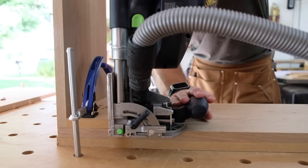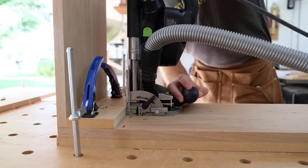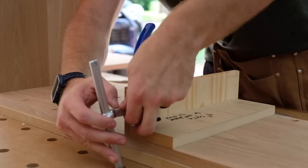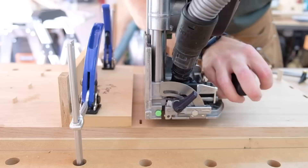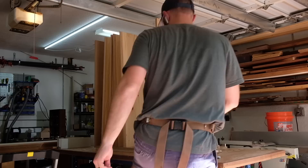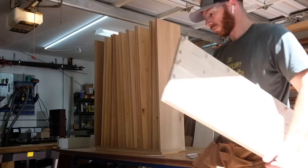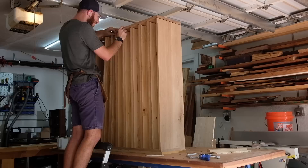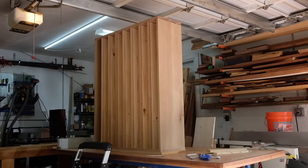With 7 dividers I had to be somewhat precise because compounding errors can really add up when referencing off the previous mortises. Usually I leave the far end of these panels long until I rout these mortises and then trim them to their final length, but I forgot to do this this time — I think I got impatient. Luckily everything turned out okay and each column was evenly spaced. This MDF spacer also has the story stick lines marked on it so I can line up the domino properly. Here's a glimpse at my first dry fit — obviously there's going to be 8 columns and 10 rows, so there's just a lot to keep track of, and that'll be a theme throughout the rest of this video.